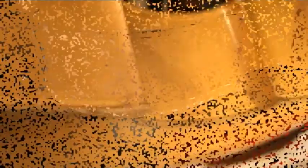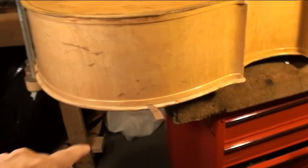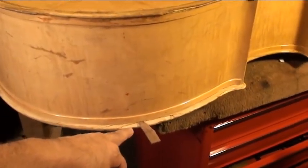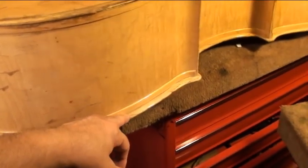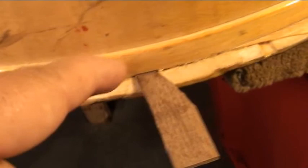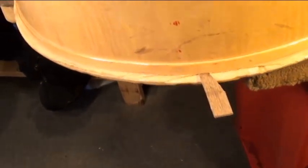Now I'm getting ready to do this one here. I've got a small wooden drift right here where this seam is separating, and that opens up a little bit. You can see a couple of secondary cracks here in the veneer — especially right there, there are big secondary cracks. So we've got to fill all this with glue and then clamp it.